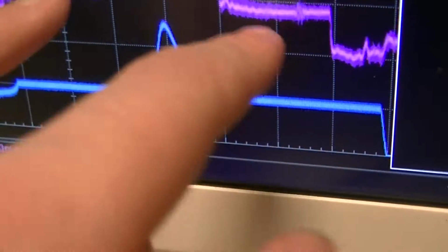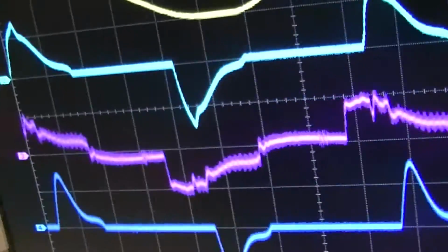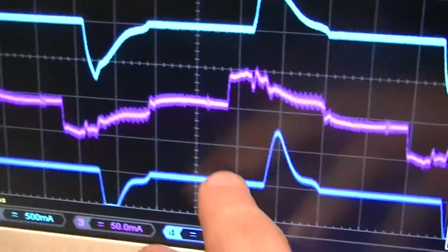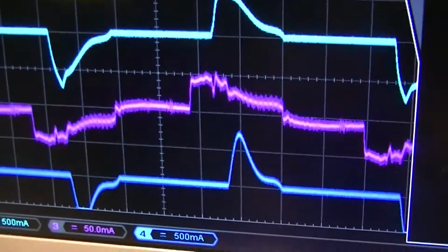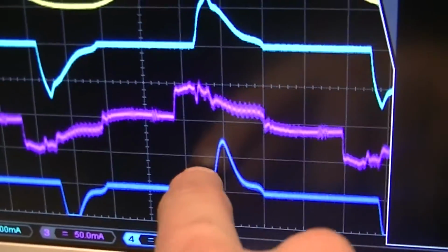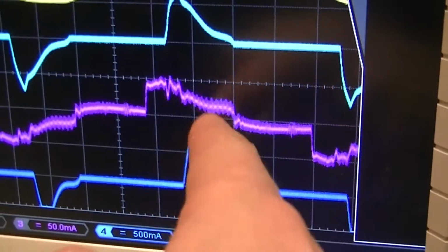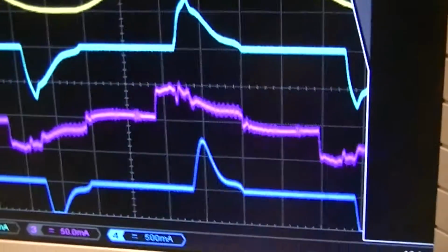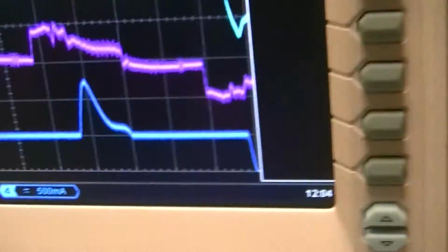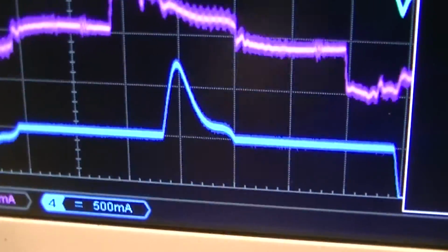But overall the load current's spread out a bit more than it is on other fluorescent lamps, where it's just this big block. Although at least this Osram one isn't a sharp spike; there is some delay there. So it is better, but that's just because, as I covered in the teardown video, it does have a common mode choke on the main supply.